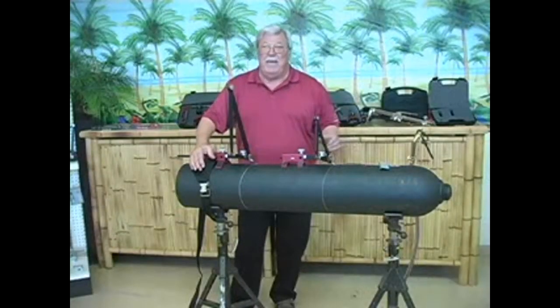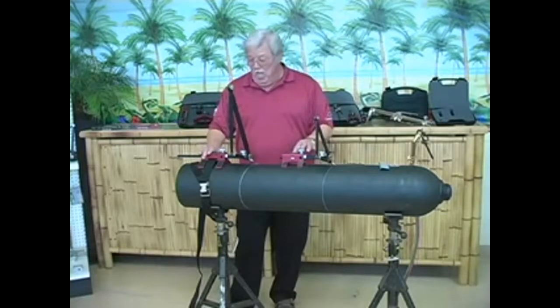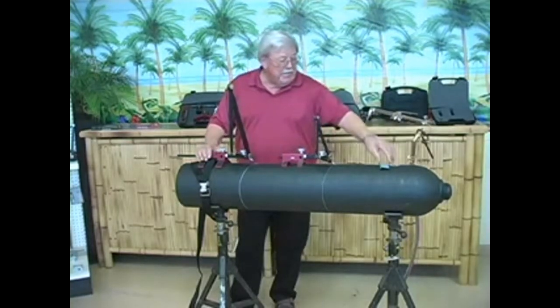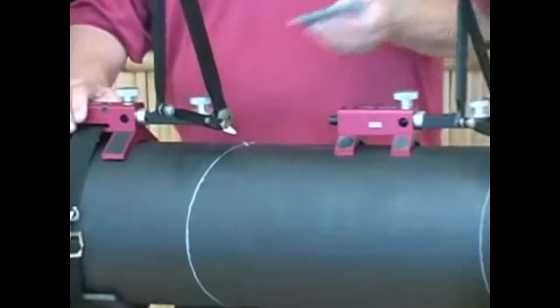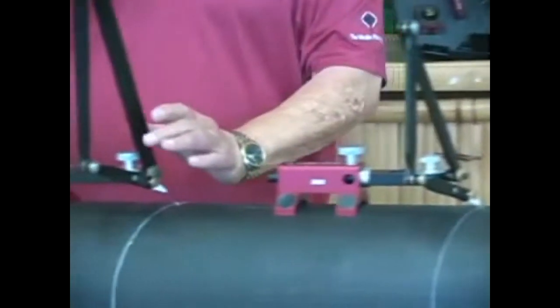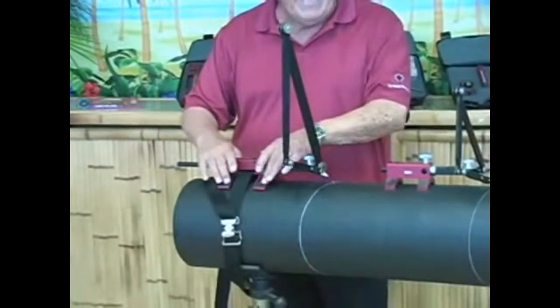The next pipe layout tools that we have, there's two models of them. These mark all your angles and saddles around pipe, structural steel beam, channel iron, plates. We have adapters that go on the bottom of these that'll hook onto the sides of square plate, and then our channel and I-beams. Now these tools right here are all magnetic, both of them.